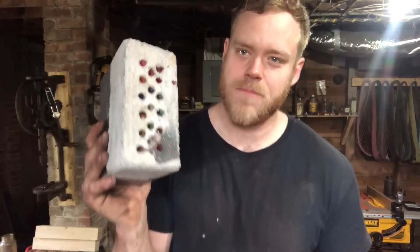With a ribbon burner, instead of one big flame you have lots of small ones coming out of here. It spreads the heat out much better - there's no dead space in the forge. It makes heat treating and forge welding a lot easier. It's actually kind of a running joke in the Facebook blacksmithing community that ribbon burners are like a cult, because everyone who has one talks about how great they are - because they are. But anyway, I'll show you how to make one.